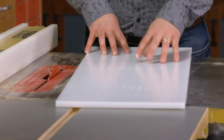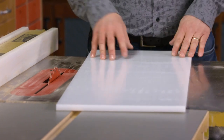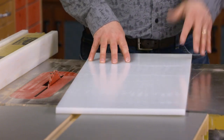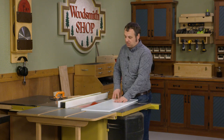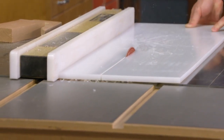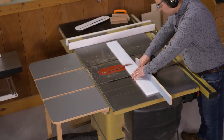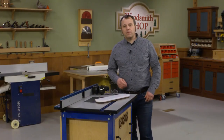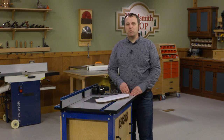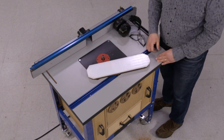You can also find this kind of plastic used in cutting boards. So if you find a cutting board at a discount store that matches or is a little over the size of your insert plate, you can just buy one of those and get it really easily. So the first thing I'm going to do is take this blank and rip it down to the width that matches the width of the insert plate. The UHMW is somewhat dense, but it cuts with kind of a waxy, soapy consistency, so it works pretty well. I've cut it to width and then to length using a miter gauge at the table saw.